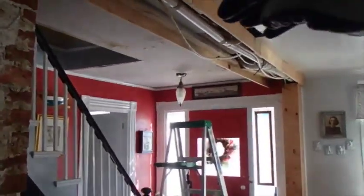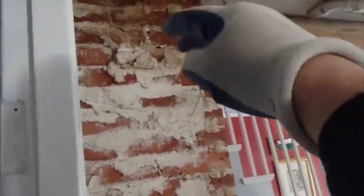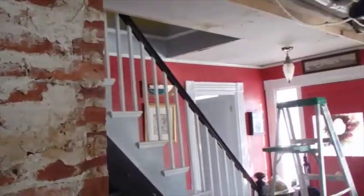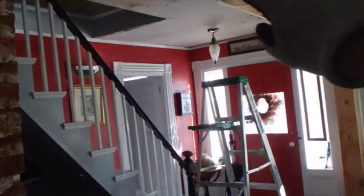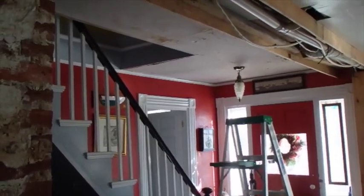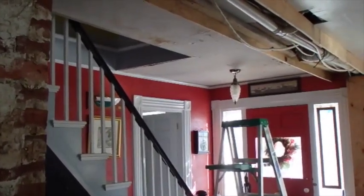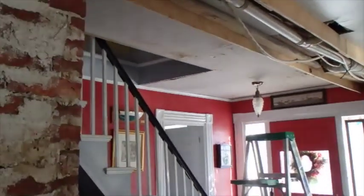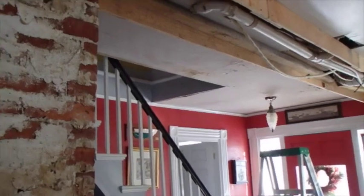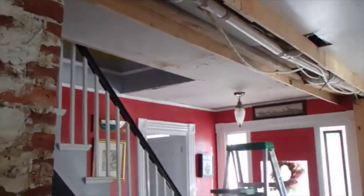I'm going to go out and cut the piece that goes up under here. I'm going to start on this end and cut this little piece with this little zag to go around the chimney. If I do an eight-foot piece, I'll have two four-foot pieces to work the two ends on, and then I can split another piece to put in the middle. That'll make it a little easier when I'm on the ladder trying to fit all this together — if I had an eight-foot piece trying to fit it to these ends, that's going to be a little tricky.